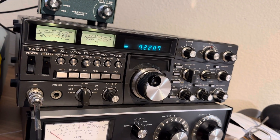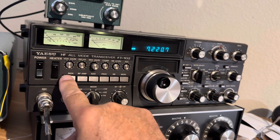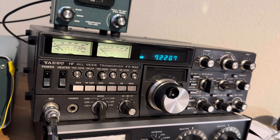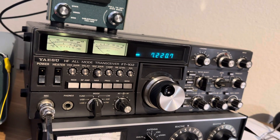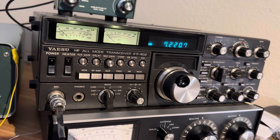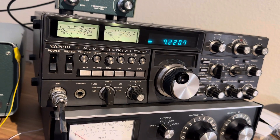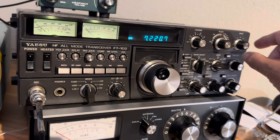Let's go to transmit — but you've got to turn the heaters on first. Turn on the tubes. That will turn on the filaments in the 6146 finals. Without those lit, nothing works. Give that a minute to come on and then we'll take our drive down a bit.